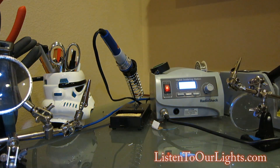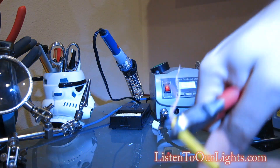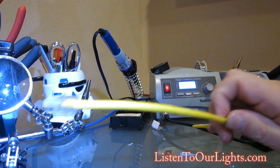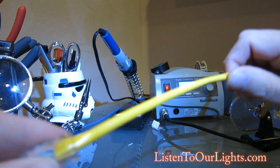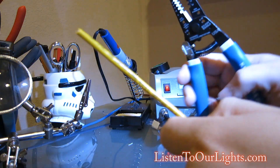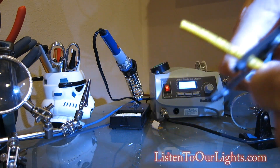Hi, I'm John Stormson. Today we're gonna make a RS-485 terminator for Light-O-Rama stuff. What I have here is one end of a Cat5 cable. Whenever one of the ends goes bad, like the little tab breaks off, I cut off the end — it's handy for this kind of stuff. So I'm gonna strip off the outer casing first.